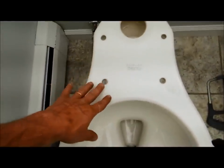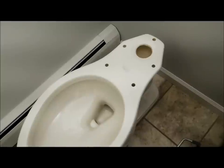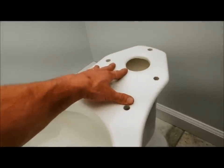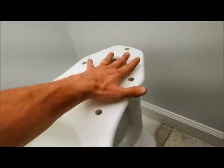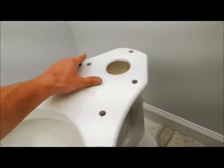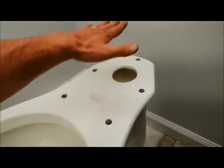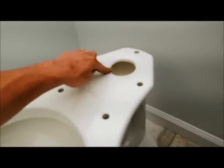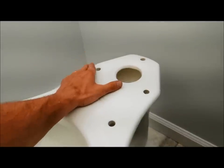If you have a one-piece toilet you're almost done, but I have a two-piece toilet here which is probably more common. The tops of these toilets go on in all different ways, so there's no way for me to tell you in advance — follow the manufacturer's instructions. You don't want to torque this thing down like the Incredible Hulk; just get things snug. When you're putting the tank on, make sure you get the tank level. It's usually two or sometimes three bolts, and when tightening them up make sure you tighten them evenly so the tank, when it's settled, is level — that's especially important. The rubber gasket here — when you're putting the top on, make sure it's seated correctly. Just spend a little extra time to take a look and make sure everything is starting correctly, and it'll end correctly too.